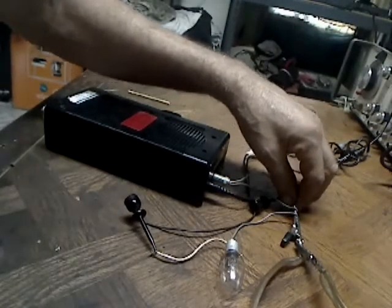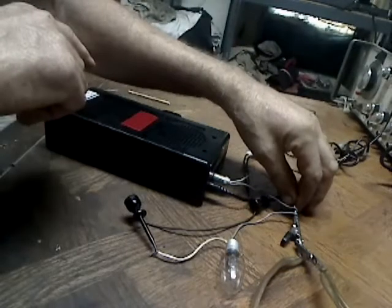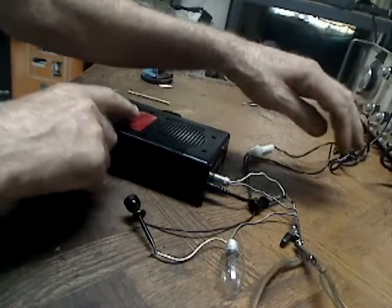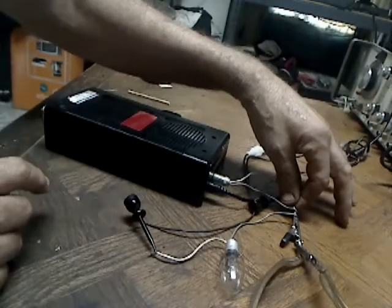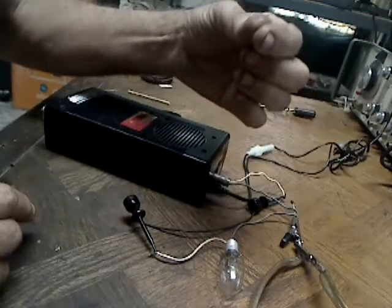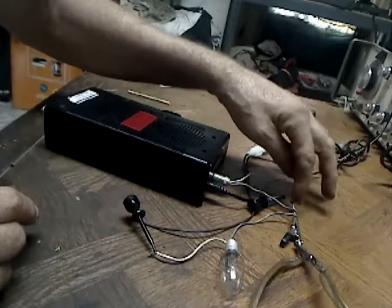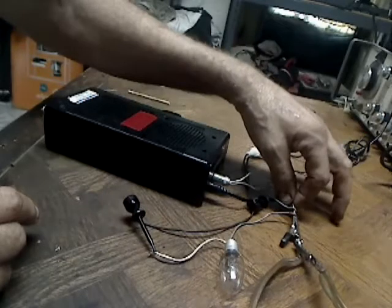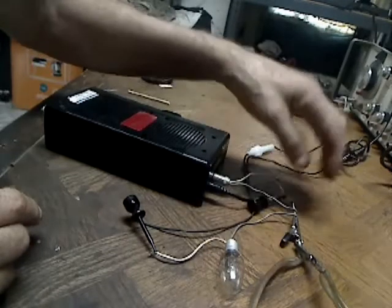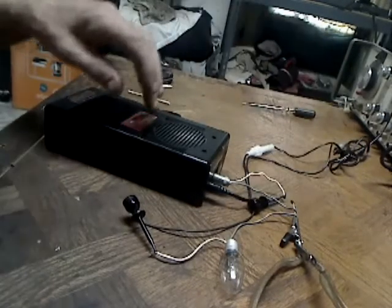This is a single. You keep it on and this gets warm — not bad. I suggest do not put your fingers across this while it's running on transmit, because I've done it already — I've got burn marks, radiation burn marks. What it does is you more or less start shorting out the diode across the leads. At about 23 megahertz with the load on it, it will jump across your fingers and you will get a little burn out of it.